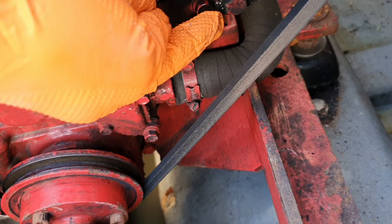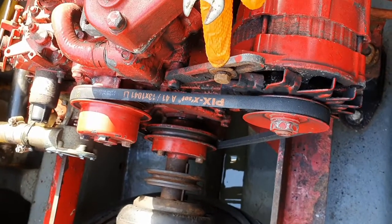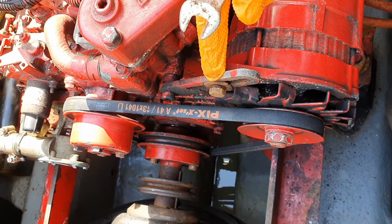You should now be able to lift the alternator and remove the old belt. You may have to cut it off if it has wrapped itself around anything. If you cannot get enough slack, remove the slider bolt completely. It goes bolt, washer, slider, washer, alternator. Try not to drop any of these in the bilge. They can be a little bit fiddly to get back into place.